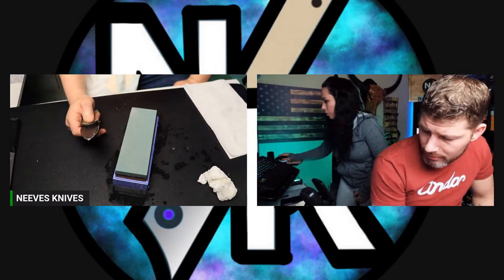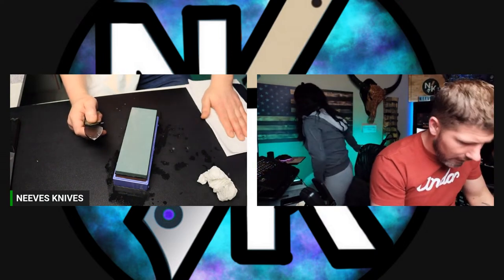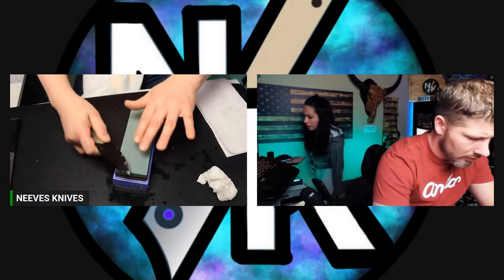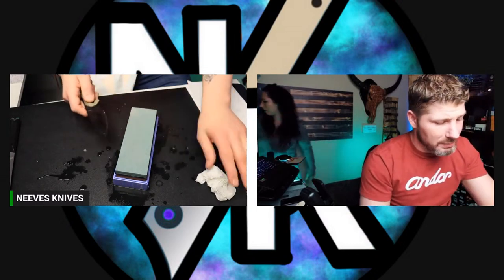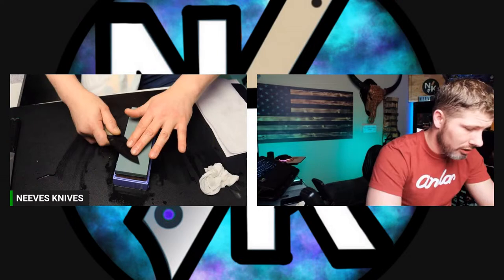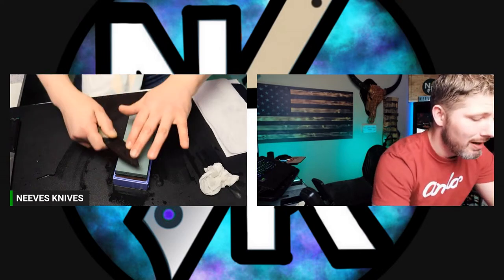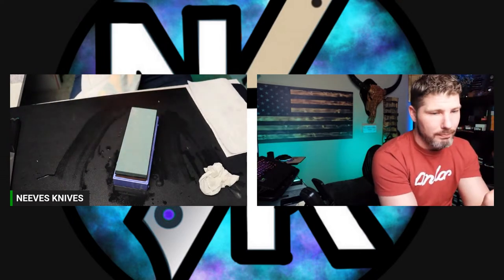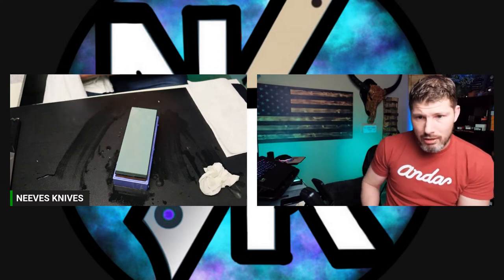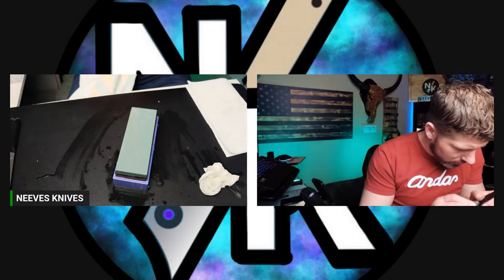When sharpening a folder, how do you prevent contaminating the pivot and lock mechanism with particles and other gunk? Oh, just try not to be super messy. If you use diamond plates, then you won't have any mess. But certain stones are going to be a lot messier than others, so it just depends on the stones you're using. If you're really worried about it, don't use messy stones. Otherwise, you might have to tape it off. You can actually tape off the pivot so that stuff can't get down in there. But keep it clean, wipe it down, and don't go really fast, because when you go really fast, that's when it kind of throws stuff in there.